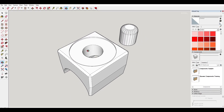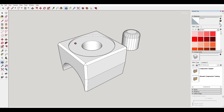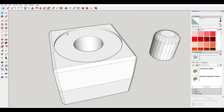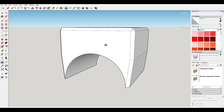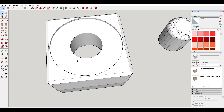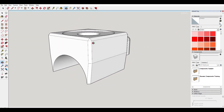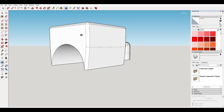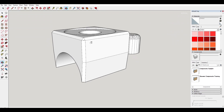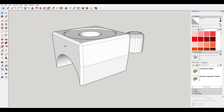Here's the design for each one of these in SketchUp. Starting at the top, we have a recess for that round washer so that the surface of the washer sits flush with the surface of the mounting bracket. This follows the diameter of that pipe, and we have a center bore here for that threaded rod to come up through. The rest is more aesthetics than anything else, so that we don't have any hard edges. I varied the infill on this until I found the right amount of squish as I tightened down on the nut — I ended up printing these at an infill of 25%, and I found that to be just right.